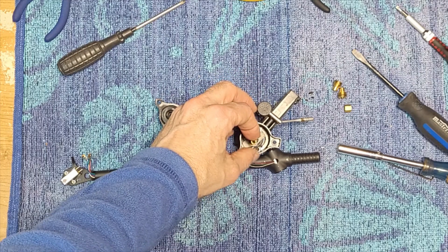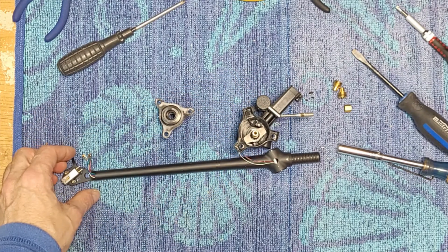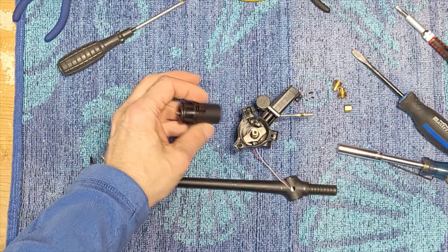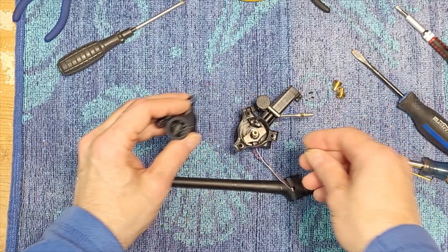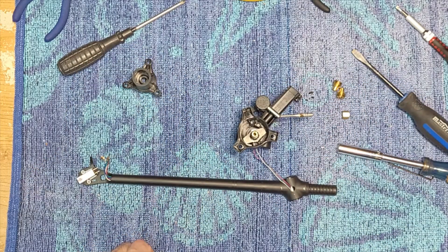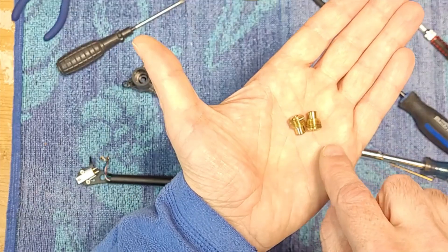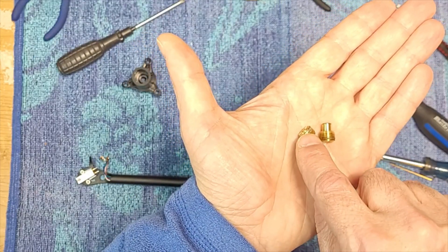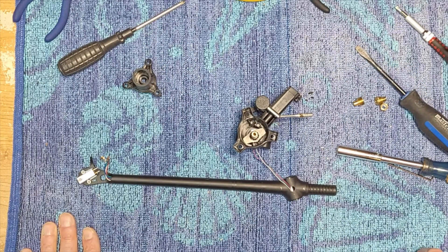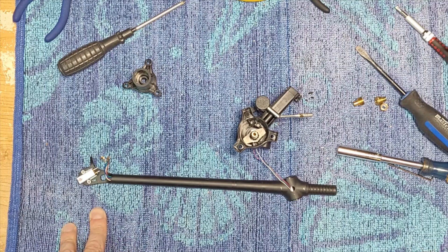At the very least, you saw how you take apart an RB220 tonearm. It's not rocket science, it's not hard to do. It's just a matter of getting this cap off and getting your big nut out from here, after you've desoldered your wires, and removing your two side bearings. They have a little bit of thread lock around them as well. I'm going to play with it a little bit and I'll come back.